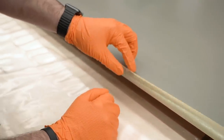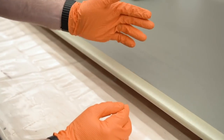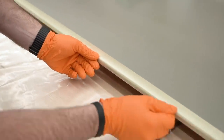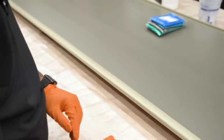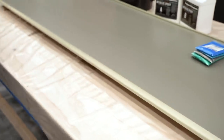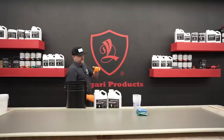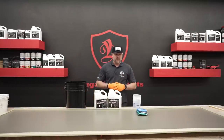There's more spot to seal to. And it's okay if the tape's overhanging in. We're just trying to create a barrier to minimize resin flowing off of there. So I'll go around and I'll tape the top edge just a little bit on the flat part, just like this. And then we have a pretty good seal there. But again, it doesn't guarantee you're not gonna have any blowouts, especially when you're coating thin boards like this. Counters, inch, inch and a half, 2 inch thick edges, no problem. It's only on these smaller type boards.